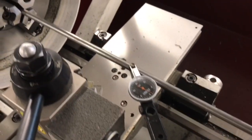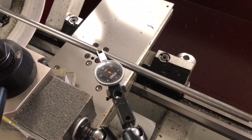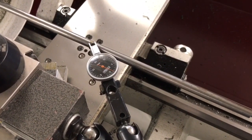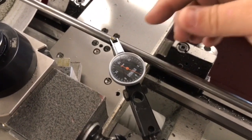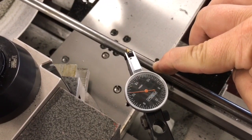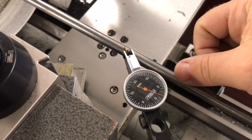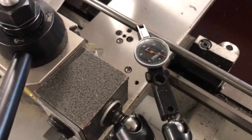Here I've got a bar. This piece is 3/8 diameter bar stock and it's an extremely long piece. I need to cut threads on this piece. One of the problems you're going to run into is it's going to have significant flex. We're not talking about a little bit of flex — you put just a little bit of pressure and you start seeing 15 to 20 thousandths of flex. That's going to give you a nightmare when it comes to threading. You're not going to have any success with that.